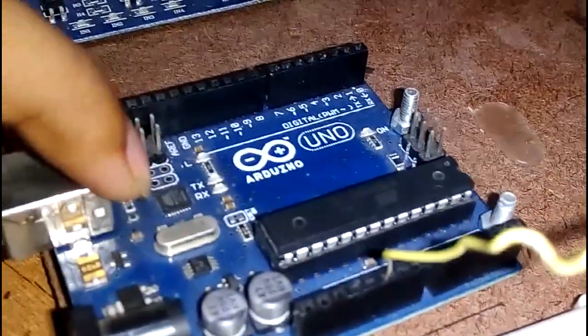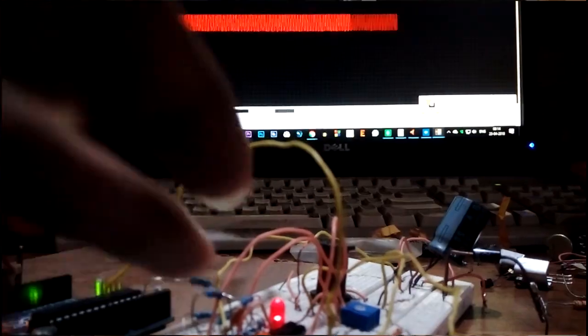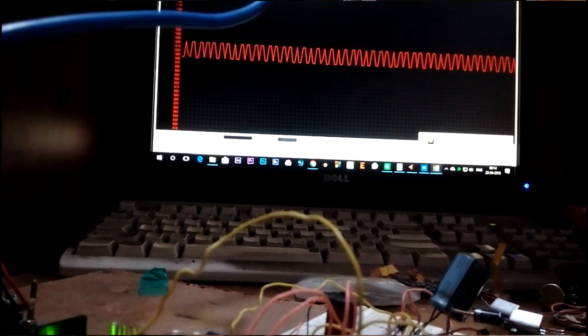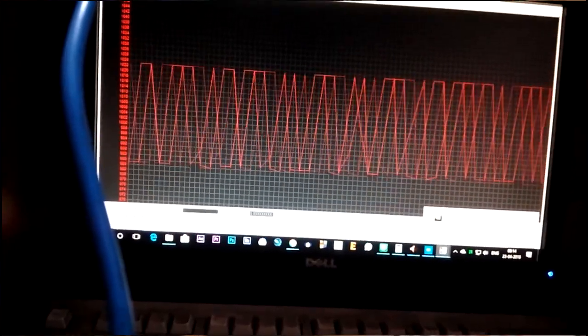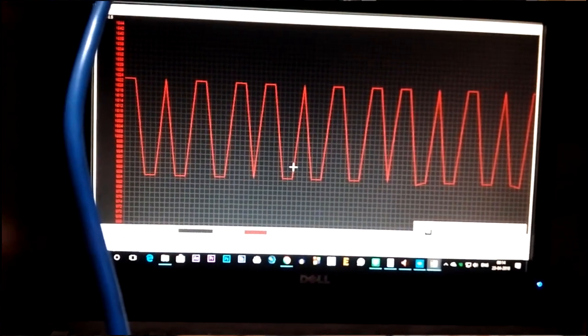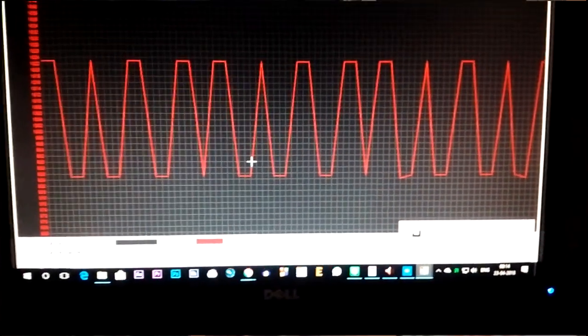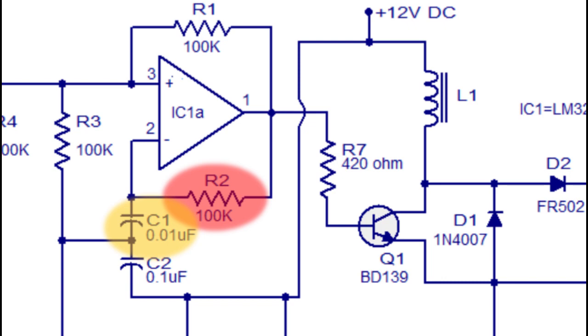After configuring the oscillator, I hooked it up onto my Arduino oscilloscope and checked the output — and yeah, that worked like a charm. You can see a PWM square wave; it doesn't look exactly like a square wave because of my Arduino oscilloscope's accuracy, but it does work. The resistor R2 and capacitor C1 are used to set the output frequency, which is nearly about 500 Hz.